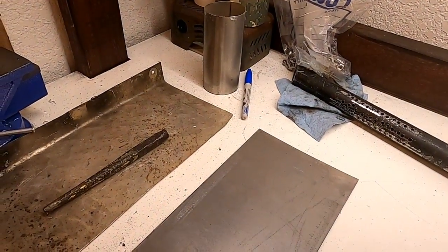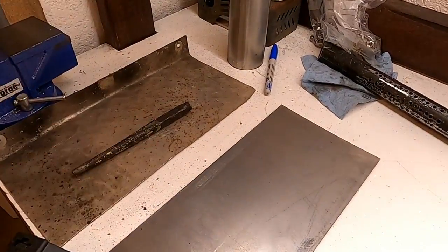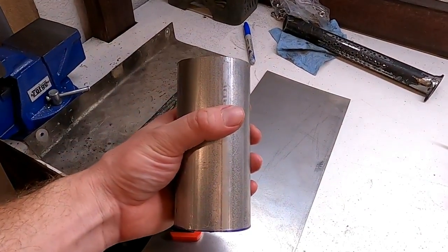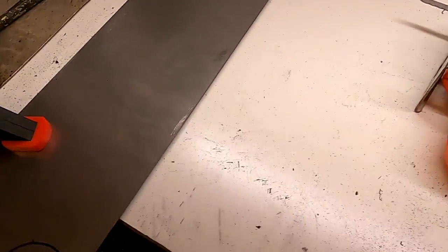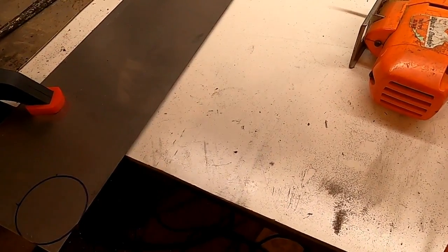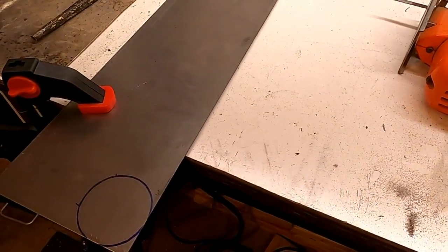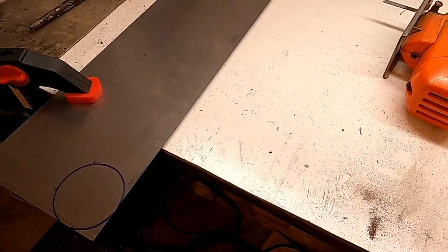So gondolas — got plenty of stuff for the next two projects on the cart, and I've got some oil and other things from Mark when we were up there, some electrical stuff. Let's finish this muffler, I'm tired of dealing with it. One of the things we've got: I've got this plate of just cold rolled steel, six by twelve inches, it was like ten bucks. So last time we saw, I had the piece of exhaust pipe. I've got that cut — it's about six inches long. As you can see, I've already traced my plug. And I'm just going to use the jigsaw to cut this out, even though I just realized I put the blade in backwards because I'm slow. So let me turn the blade the correct way around and we're just going to cut this little guy out, make sure he's the right size, and grind him smooth.